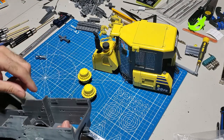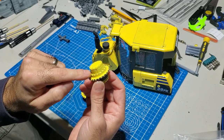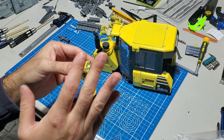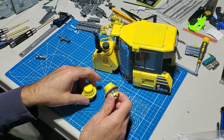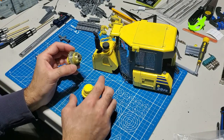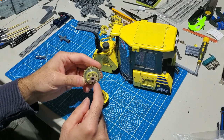First we'll go to the sprockets. The sprockets are a three-piece: there's the cap, the main sprocket itself, and then the hub. This hub is a six millimeter shaft hub. All the parts and fasteners I'll put in the description of the video as well as on my Facebook page. We're gonna order two of these - they usually come in a pack of two.